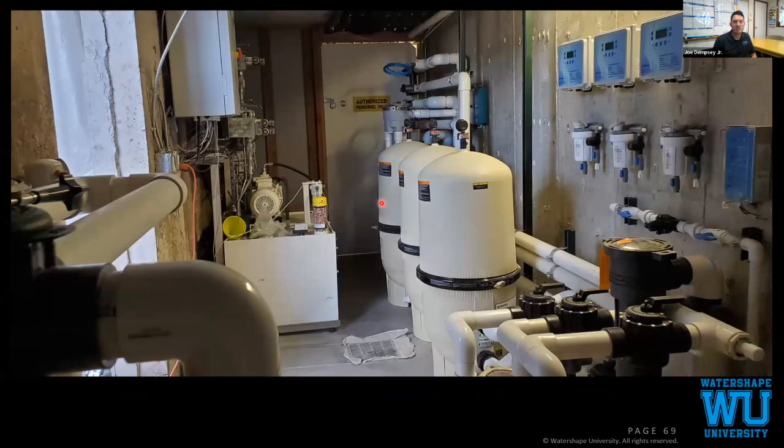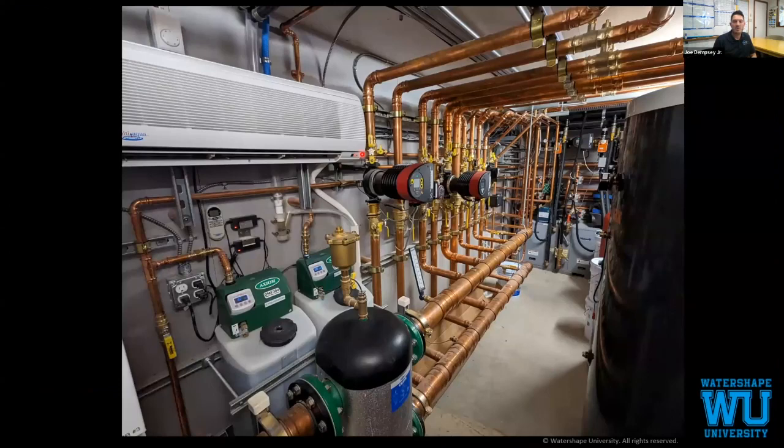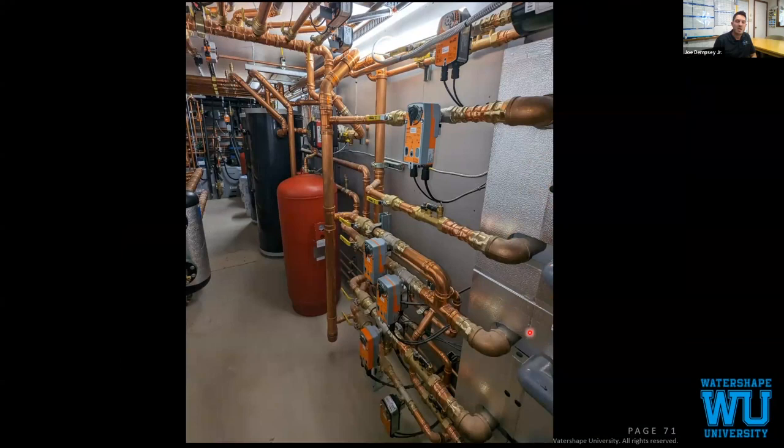Behind the authorized personnel only, this is the boiler room. Impressive, again, 1.4 million BTU, 15 tons of cooling. Everything that touches the water is titanium. Make sure that as our chlorinated pool water comes into contact with the plate heat exchangers, the temperature sensors, high limit switches, all those wells are also either stainless steel or titanium.